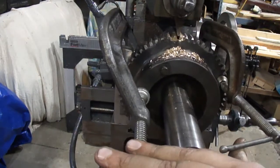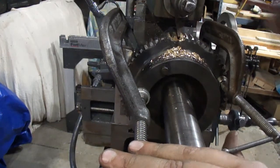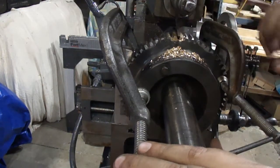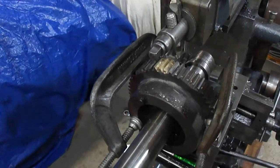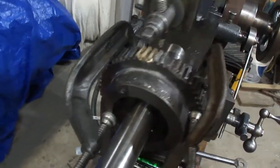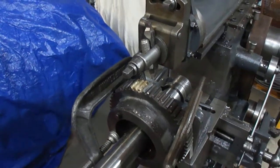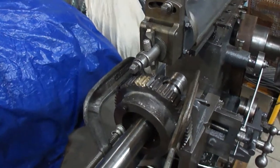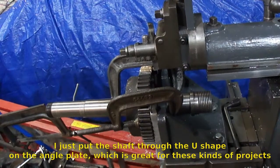There's that tooth. And one more just to clean up. All done. I think they turned out quite nice. I just ground the bit to the profile of the teeth and I might need to do a little file work, but that's about it. I'd say that is a success.